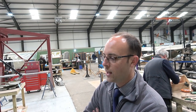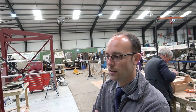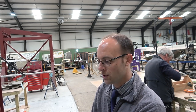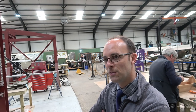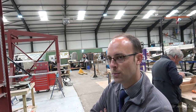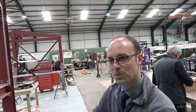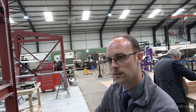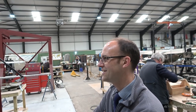What that's not taking into account is that if we try to keep the original spars, the CAA may say, because they're originals and you haven't got a record of everything that's happened to the aircraft from year dot to now, we are only going to give you 500 hours on them, and then you'll have to change them. That's not a conversation we've had, but it's the sort of requirement they would have because of the unknown aspects and it being left outside for 30 years or whatever. So changing them is going to get rid of all that? Yes, no problem. All right. Thank you, Andrew.